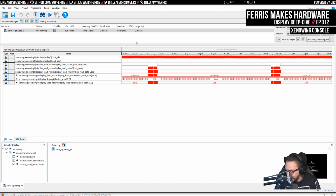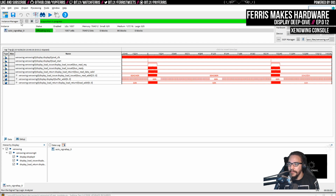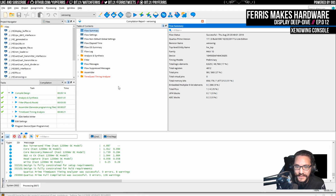Okay, so now I'm seeing my LEDs working. That's fading like it should be. And captures of this still look fine. Although here we can see the buffer address only starts changing here. And that might be because I think we got the 0th line, which would do that, because this still has the preload code. So I think that actually makes sense there.